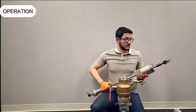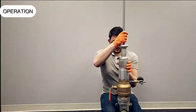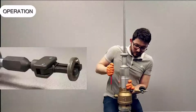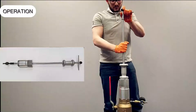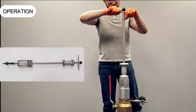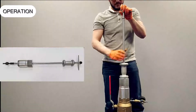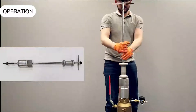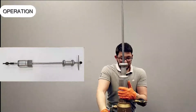Attach the flapper removal tool. This tool has a two-leg jaw attachment that inserts behind the flapper ring inside the T. Once the jaws travel through the flapper, turning the shaft clockwise while exerting downward pressure opens the jaw legs, anchoring them behind the ring to allow it to be safely hammered out of the T with the slide hammer.